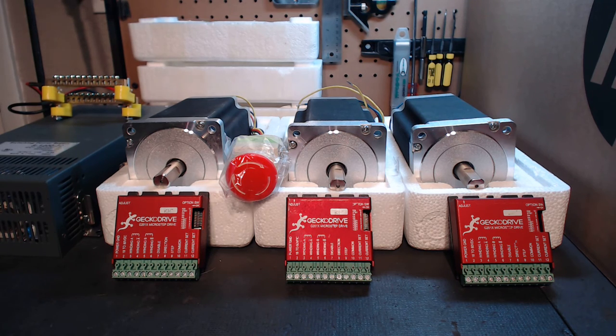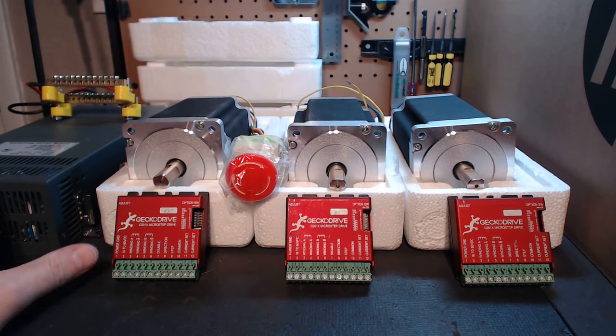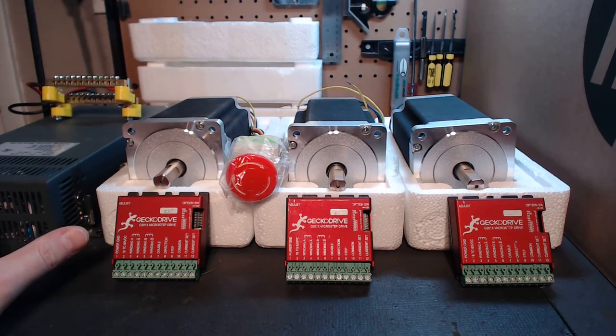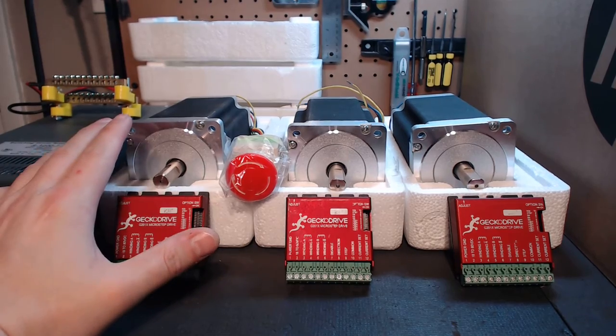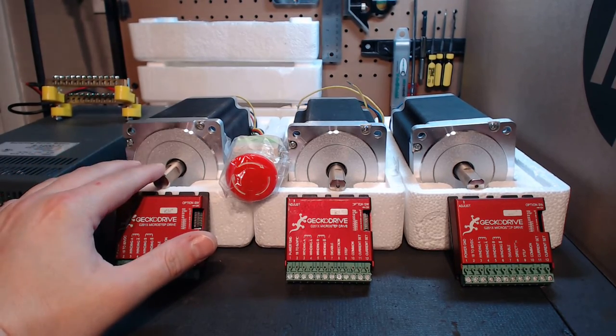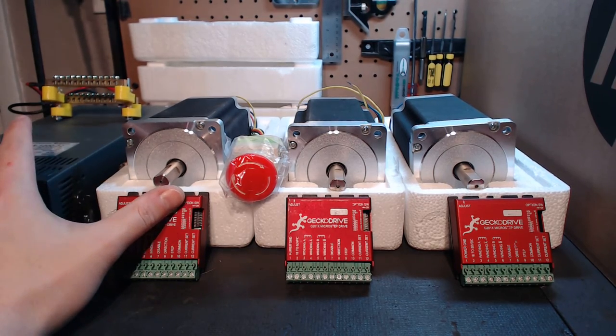It's one of a kind on the market right now — there's nothing as simple as that to work with, and that was my overall goal. It's a 16.5 amp model at 1200 watts. It does have the integrated cooling circuitry so she'll keep herself cool. It's designed around ProGrade use, and with 72 volts you have about a 10% buffer for max voltage input, which guarantees that the drives are safe. With these steppers, this power supply, and these drivers, you do have a ProGrade setup.